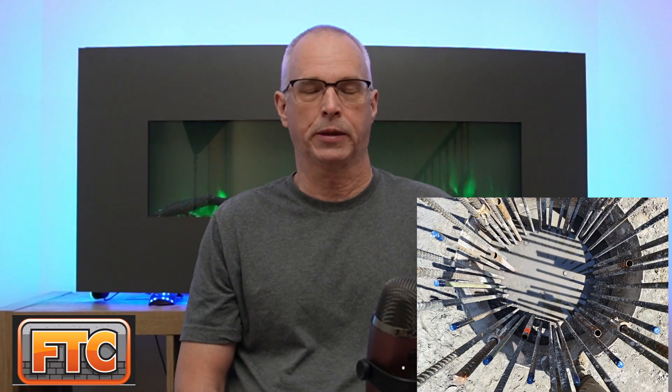This test involves the installation of typically two-inch diameter steel access tubes tied to the main reinforcing cage before the concrete is placed in the shaft. After sufficient curing — typically two to seven days — the CSL test is conducted using a pair of probes lowered to the bottom of the water-filled tubes, recording data every two-inch vertical interval.